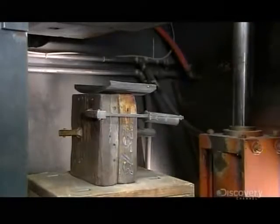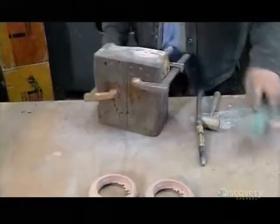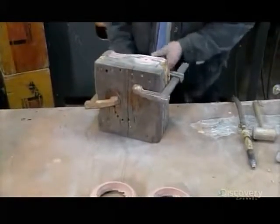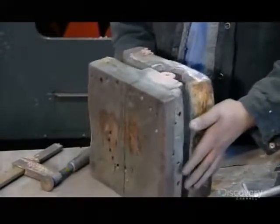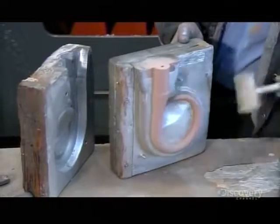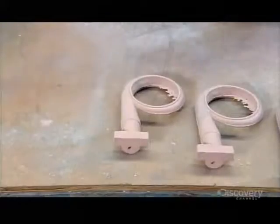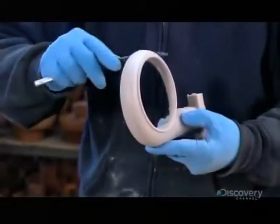Production begins at the foundry. An overhead sprayer blows sand into the shaped cavity of this box. The spraying action activates a binder applied to the sand. This causes a chemical reaction that solidifies the particles. The worker extracts the hardened sand shape from the box. The shape is called a core. It will be used to mold the inside of the turbocharger's housing.